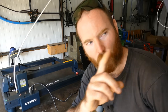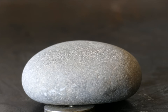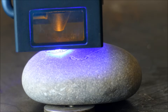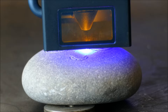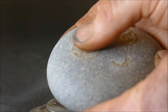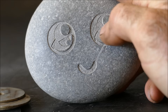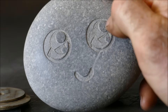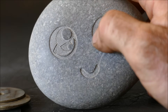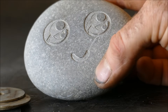While waiting for the glue to cure, I'm testing subscriber-suggested materials: stone and leather. The stone result is amazing — it's etched incredibly deep. The funny swirl lines are from using offset fill, where the laser spirals rather than scanning side to side. That was 1,500 mm/min at 100% power. I'm going to test again with an inscription on the back.